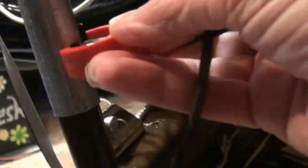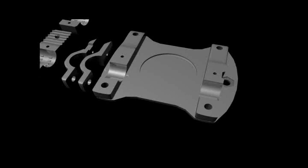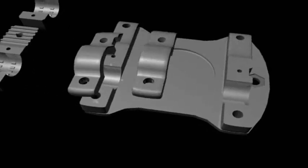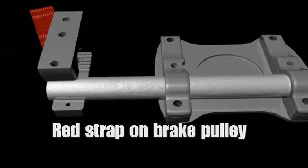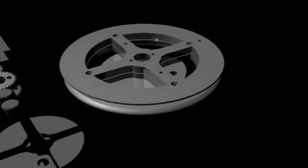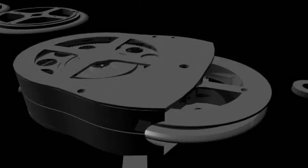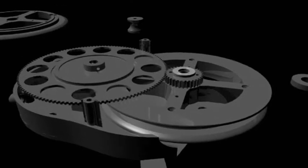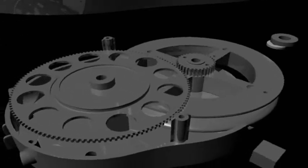The frame can stay mounted to the chair or ceiling without interfering with anything else in the studio and people banging their heads on it. The gearboxes are attached to the pipe using a sort of clamp layout which is in turn bolted onto the boxes themselves. Another clamp is to attach a DIY brake pulley. The pulley is sized for a full stroke from hands up to deep into the brakes over 3 turns — the ratio is 3 turns or about 1080 degrees to 1 potentiometer turn which is 270 degrees.